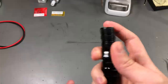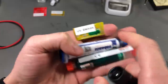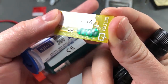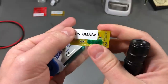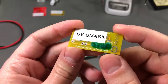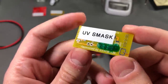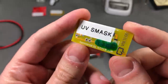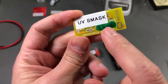You'll need a UV source of light like this flashlight. You put a drop of the UV solder mask on the PCB, shine the UV light for about 30 seconds, and the stuff will harden to a nice protection layer. I'll add some links in the description to both the solder mask and the UV flashlight that I am using. But this stuff also has some limitations. Because it's pretty liquid, it works best on flat surfaces. You can't coat an entirely assembled PCB in this stuff unless it's very small SMD components — otherwise it's just not practical and you won't get good results. It works best for flat surfaces like exposed copper on a PCB or very small mods and repair wires.